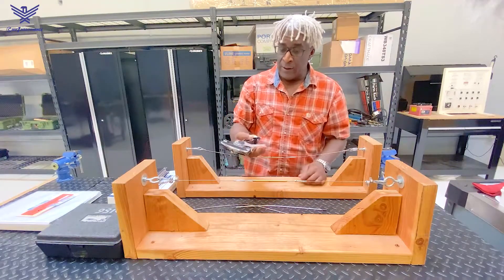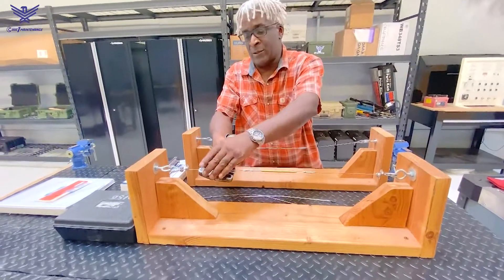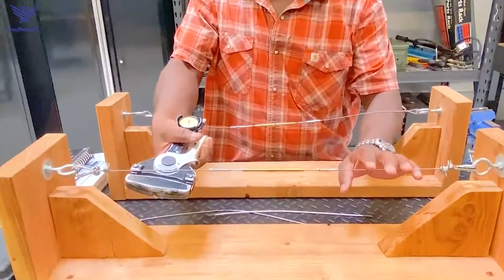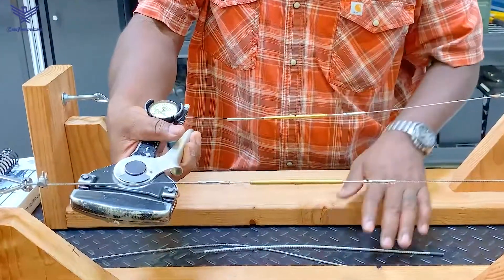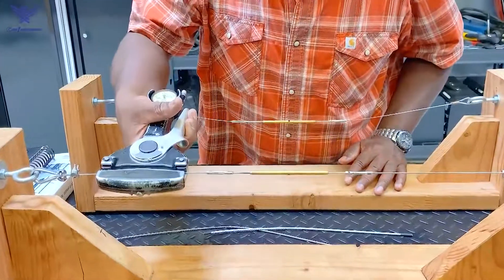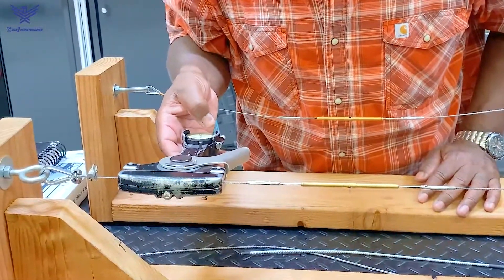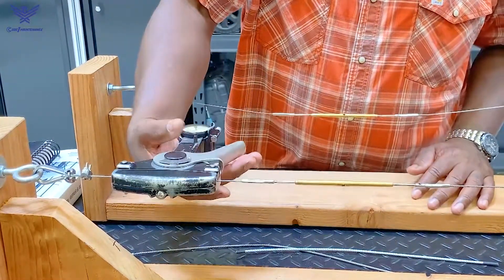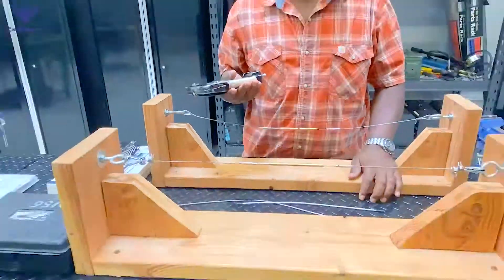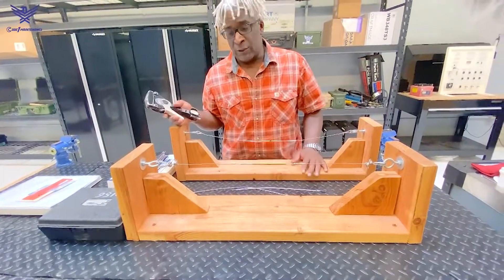Now that I have the tool set to the correct cable size and the dial to the correct reading, I can go ahead and take a reading. It's as simple as finding my cable. Remember when you're checking cable tension, you want to make sure you're in the middle. These are desktop apparatus for practicing and for testing on a practical, but on an actual aircraft we would find a span between the two cables. Once I put it on, I can release and I have a reading — this cable is reading 27 pounds. I could jot that down and see if it's within spec based on the manufacturer's data, and adjust the turnbuckle to loosen or tighten to get where it needs to be.